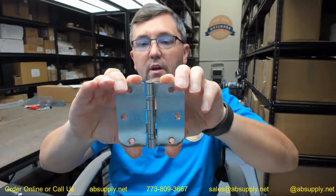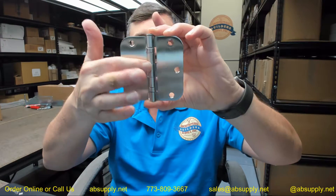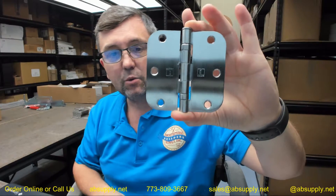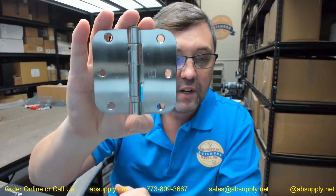Being ball bearing is going to make it a very durable, long lasting hinge. If you were to look at a plain bearing hinge after 20 years of use, even residential use, there is a noticeable amount of fatigue between the knuckles. But when you throw a bearing packet into it, your life expectancy is orders of magnitude longer. If you have a commercial application, don't mess with plain bearing — ball bearing is not much more expensive and significantly increases the life expectancy, by a factor of 2 or 3.